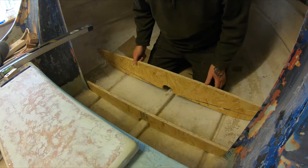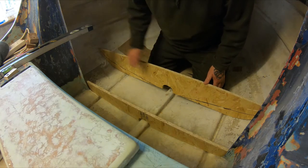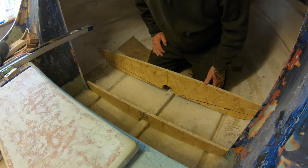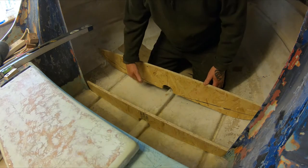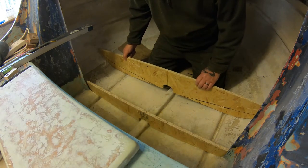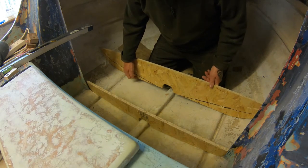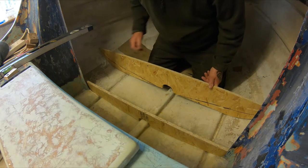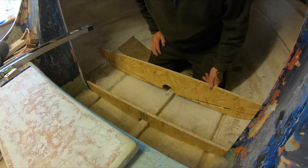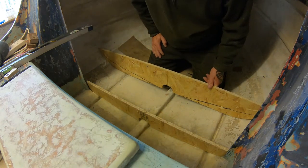And then it's only plywood, but I'll use polyester resin, and I'll paint all this timber with polyester resin. That'll waterproof the wood, and then I'll fiberglass it to the bottom and up the timbers with fiberglass sheeting. That'll make this perfectly waterproof. I'll cut a couple of holes in the bottom here, so if any rain did splash on this side, it can drain back down. Same through the centre, these gaps there, and there's channels on the side of the boat here on the bottom that run to the back towards the bilge pump.